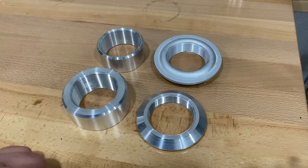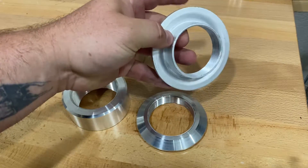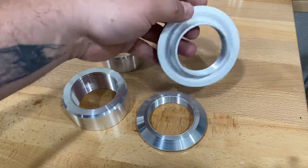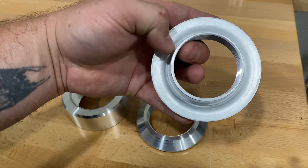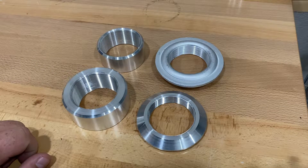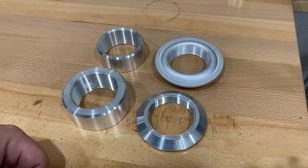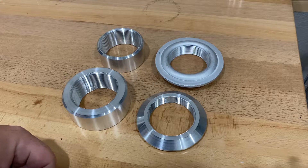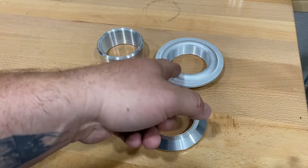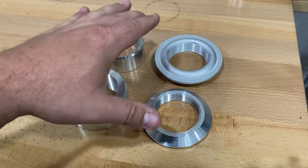It's a cheaper fitting, but it has a flange around it. You would cut this diameter of hole in the tank, overlay it over the hole, and weld around the perimeter. The wall thickness is not very thick, so this is really only used for no pressure whatsoever — just general tanks where you need a connection to a fill neck, a pump, or similar. That's the flanged stamped fitting.